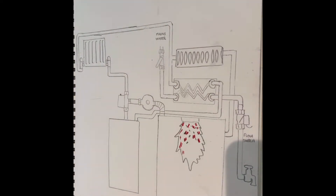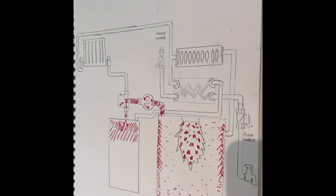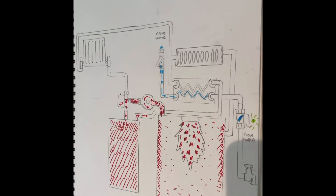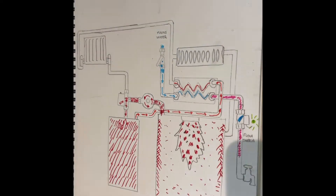As soon as the boiler gets a demand, it will start heating up the primary heat exchanger. This heat will then be pumped out to a diverter valve, where it makes a decision whether you've put it on heating or hot water. If both are on together, hot water will dominate — this little buffer tank really wants to be up to temperature to enable hot water to work properly. The movement of water is detected by the flow switch, which ensures hot water dominates even if the heating is on. Water then moves through the hot water plate-to-plate heat exchanger, absorbing heat from the dirty central heating water into the cold mains, giving you hot water instantly.